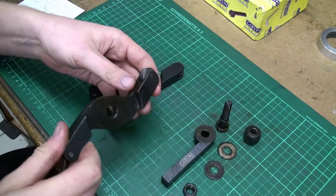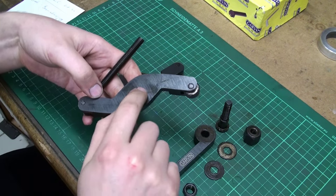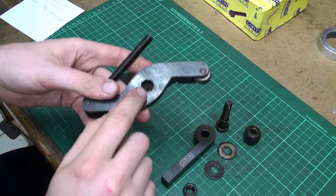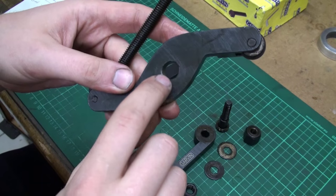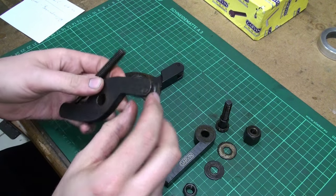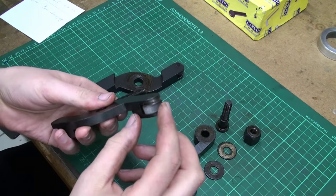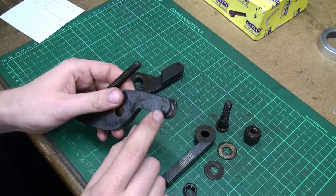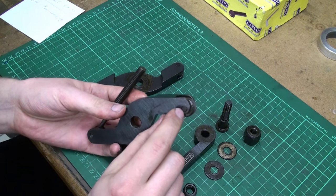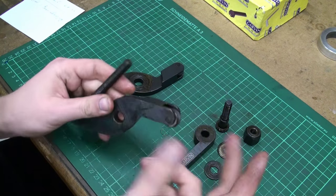But the finish is just not very nice. This looks like somebody ran a big dull face mill over it. The counterbore here, or the chamfer on the bore, is all chattered up. It's got chatter marks all around. It got dinged up here. The pins where the knurling wheels ride on are pressed in. If I keep this tool, I'm going to replace the knurling wheels with high quality European made ones. Then I will have to push out these pins, maybe make new pins or use 6 millimeter hardened dowel pins, and put them back together.